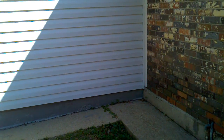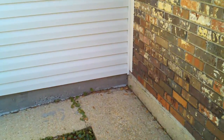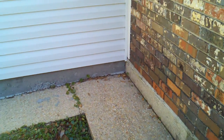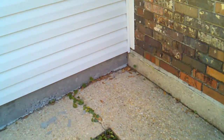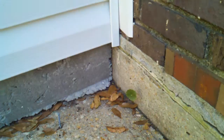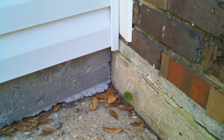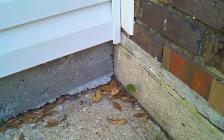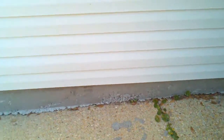Hi, it's your favorite Pensacola home inspector coming to you again. I wanted to show you some things we're finding on a house we're inspecting. They did an addition on this house and what they did was pour a slab right on top of the old back patio slab. If you look down here where the new slab butts up against the old slab, you'll find what's called a cold pour joint. Since this particular slab isn't tied into the main foundation, it's going to have a tendency to shift and separate.